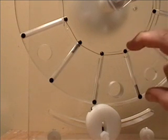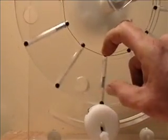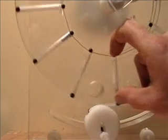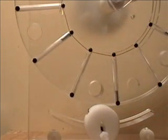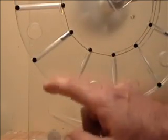Now, the ferrous pins are a bad idea because, of course, they will be attracted to whatever magnet is doing the pushing, and there will be what is called a wall in the vernacular, what is really an energetic minimum at this point. Hence, the wheel will tend to cog and stop at that point. The idea that JK had was to replace the ferrous pins with a continuous wire all the way around, a wire that's ferromagnetic, and so I've done that.